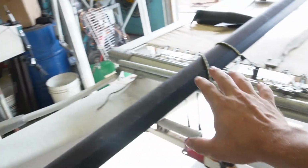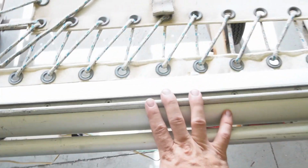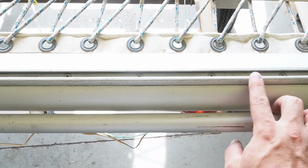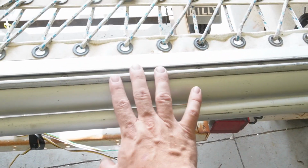It's just a little electric motor, not too fast or anything. We're going to be mounting that motor. This is the rear of the boat, and we're going to be building a mount for that motor right here. If you look down in the channel, there are little rivets, so we're going to cut out this side of that rivet and this side of that rivet, then drill those two rivets out and remove this piece, and then build a mount to hold that motor.